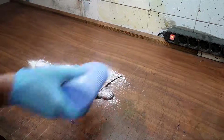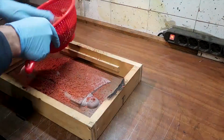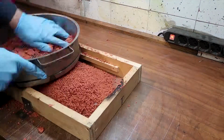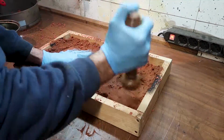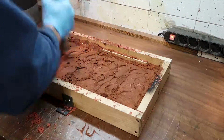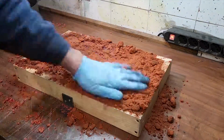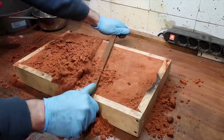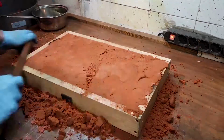So this is the part of the video where I make the mold out of Petrobond sand. You've probably seen this process quite a number of times on my channel already, so I'm not really sure what I should say anymore. It's just a matter of placing the pattern and then dusting on some baby powder to help it release from the sand. Then I'm sifting the sand for the first couple of layers to help capture all the details. And then it's just a matter of ramming it up real well so that it holds its shape.